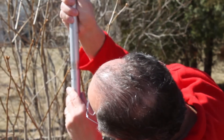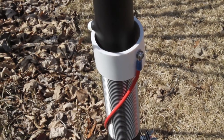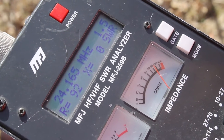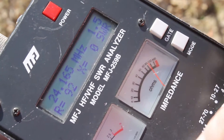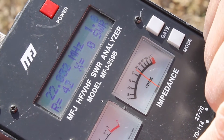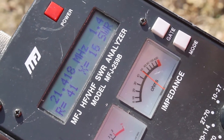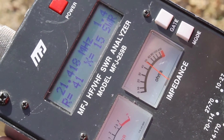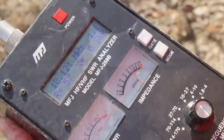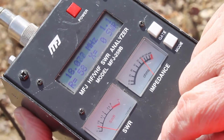I got to get the pins lined up — there it is. Let's see where we are. One section removed and the collar at the very top — there's 12 meters, and you can see it's very acceptable. This one, if you go down, will actually get you to 15 meters. So that's 12 and 15 from the very top. I moved the collar down four clicks, and there's 17 meters — one to one — and again, you'd get the whole band, that's for sure.